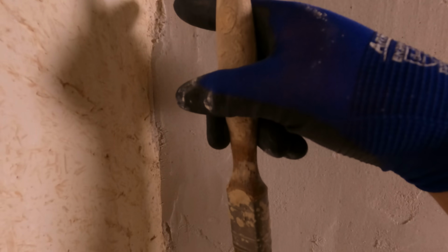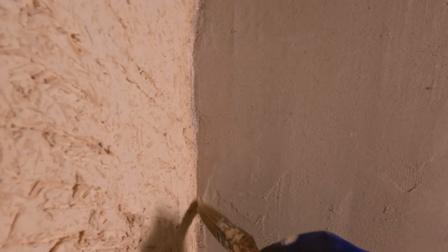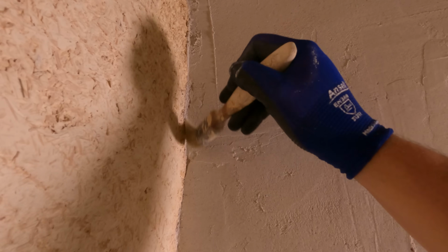So you see these slight inconsistencies in the corner. I'm hoping that with a wet brush, look at that. I mean, obviously I've got this wall still to do and I'll have to blend them at that time as well. That seems to be working quite well. Well, the brush technique worked a treat. This gives me high hopes for what the sponge float can do to fix some of my trowel skills, or lack of trowel skills. But I'm quite pleased with how this has gone on.